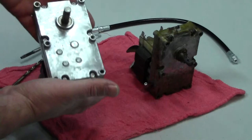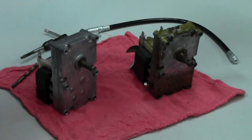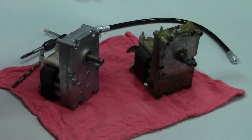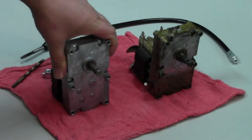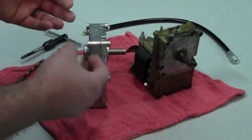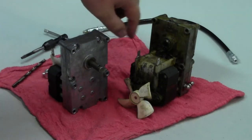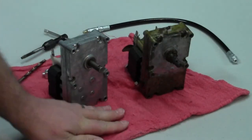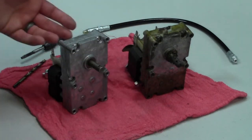This is what it looked like when it was brand new. The problem with my setup is that I had to take a back panel off and remove 8 or 10 screws every time I want to grease this. It doesn't get super hot, but it gets warm enough that the grease flows and it started leaking out of the casting where the two parts join. It also leaks out around the bushing. I grease it a couple times a season, which helps cushion the noise and vibration when the thing is running, but obviously it's made a mess.